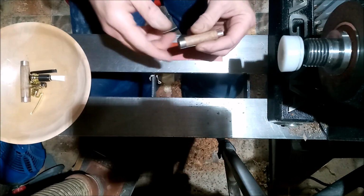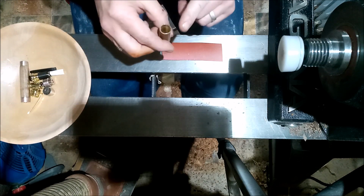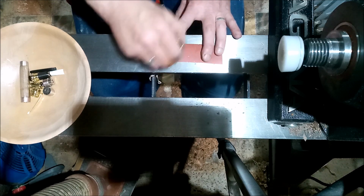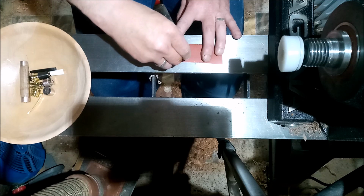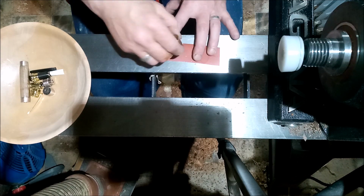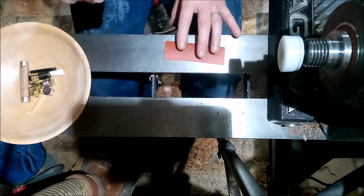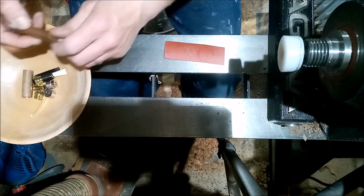Right, assembly. Something I always do in assembly is I will always give the ends here a rub on 320. Now, don't do it that way, moving around. Just put it down and twist it. If you do this, you stand a fair good chance of tearing that wood. Really all you're doing is taking any type of little burr off of it. Doesn't take much.